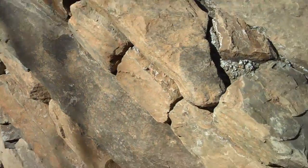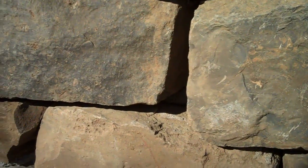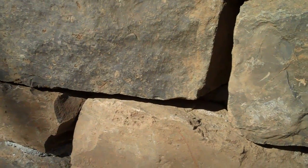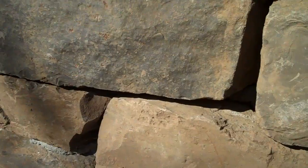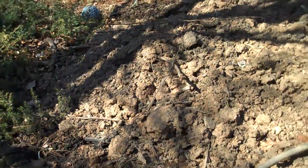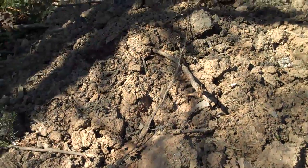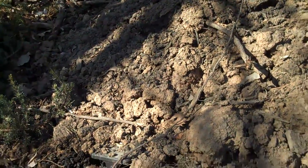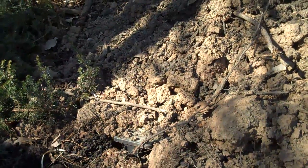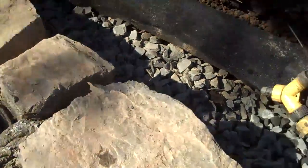Another crucial part is that in dry-laid walls — which this is — one of the benefits is any pressure or water that's coming down through the walls seeps through the walls, again alleviating some of that pressure. Basically what happens on a hill is a retaining wall retains soil. Number one, there's pressure with the soil. Number two, when it rains, there's added pressure with the water. So you want to alleviate that pressure behind the retaining wall.